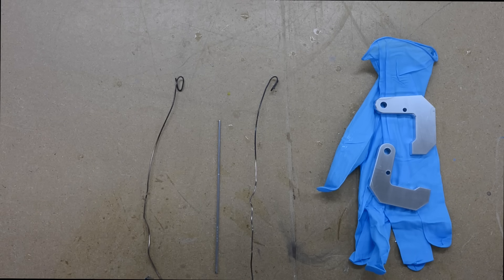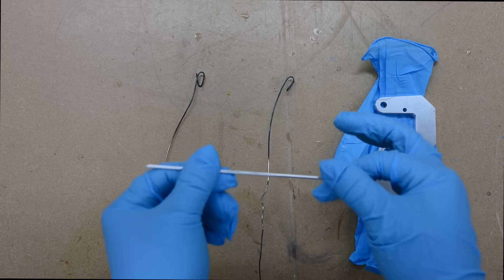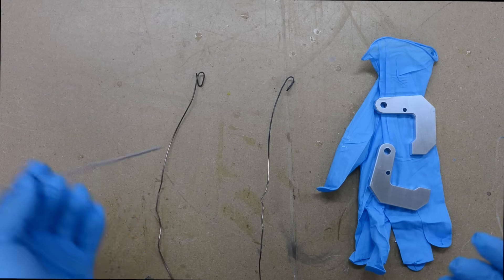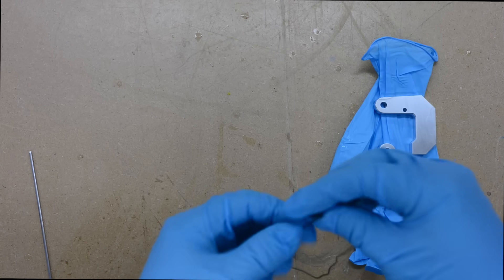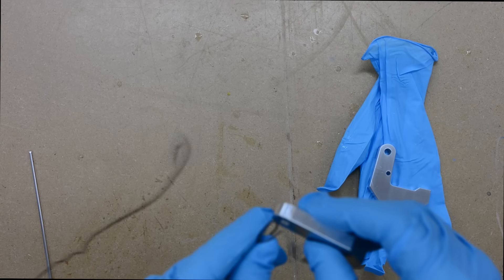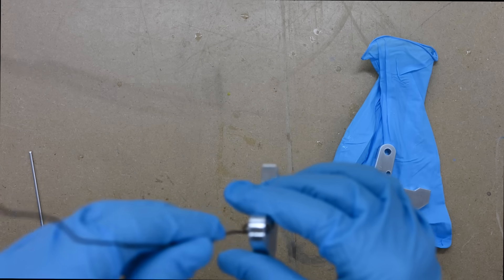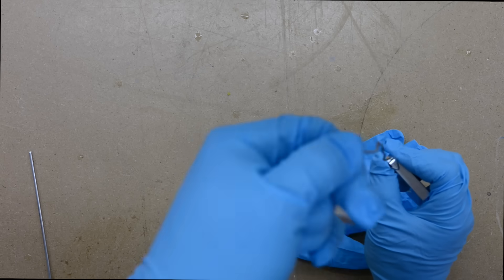Now that the parts are all clean, we can talk about racking. I bought some titanium wire, but that's totally not necessary - aluminum TIG wire works great. The thing with aluminum TIG wire is it's a one-time use. After you've used it in anodizing, it gets anodized as well and becomes an insulator, so you just have to keep throwing these out and using new ones - where the titanium you just keep using over and over. To rack it, I make this loop shape and stuff it in the hole. You really do have to make sure you've got a good connection, because if you lose your connection or it gets anodized underneath that connection, you're going to lose your charge and it just won't work anymore. Make sure it's good and tight - see, that's too loose.